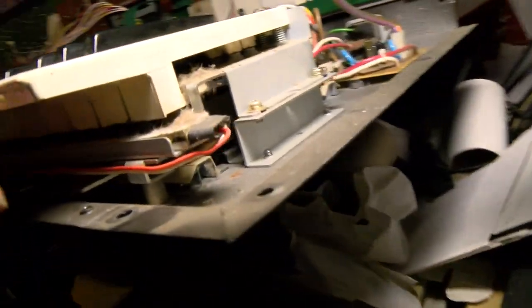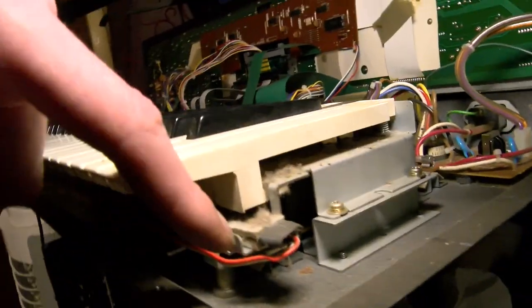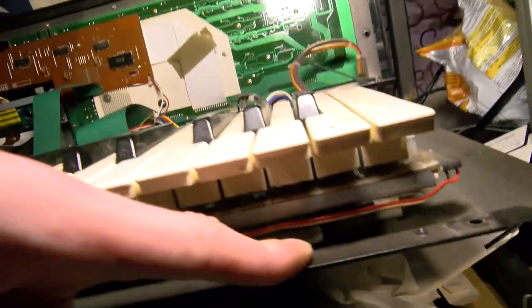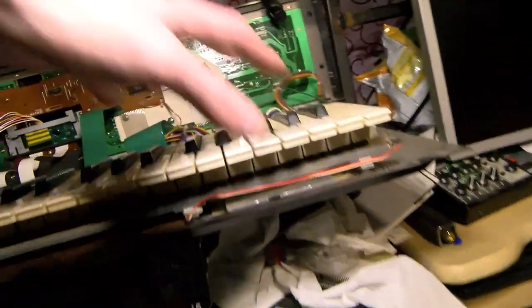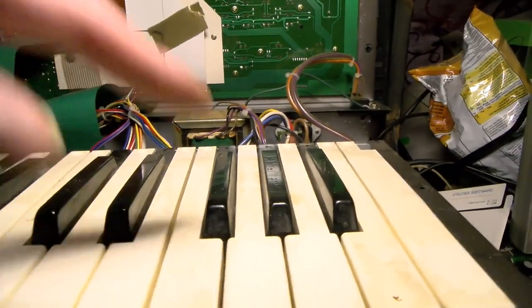To which end, disconnecting the EL driver will probably remove a little bit of noise from the system, even if it is getting filtered out quite effectively. You've now got less risk of it, because now you don't have this flip-flop running at a million miles an hour. Anyways, we know how to take the original display out and put one of these modern LCDs or alleged LED displays in there. But that's a bit boring, and now we can just be silly, as there is another option, and one I really don't recommend.